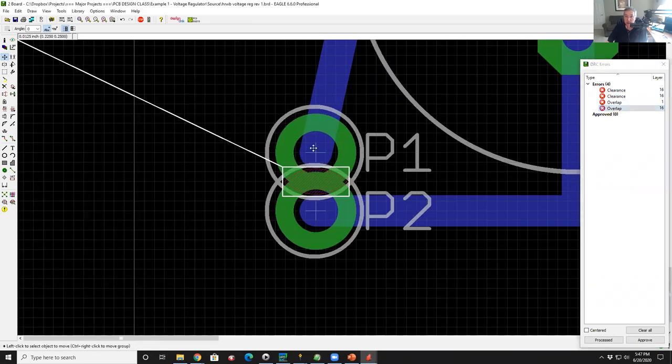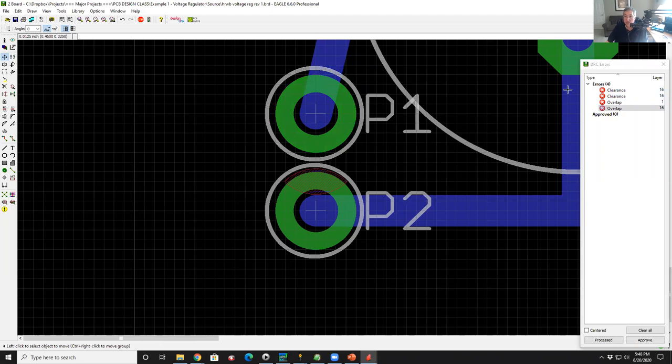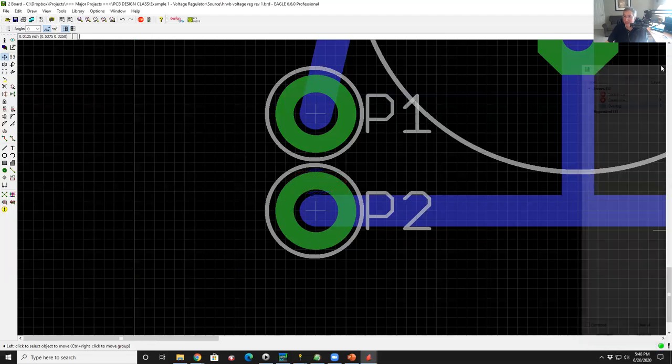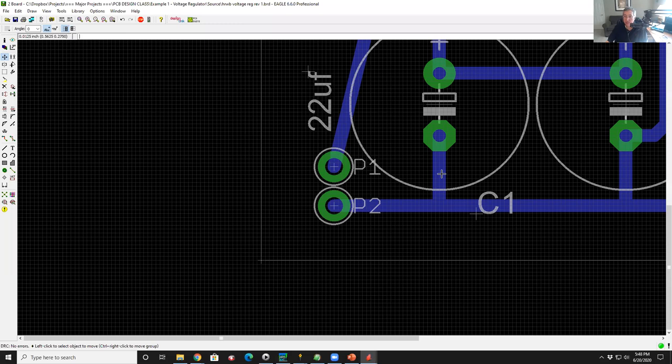So if I come back here and grab this pad and pull it back, let's say to there, and then approve all of these. I'm going to undo this, and I'm going to rerun my DRC check. And now it passed.